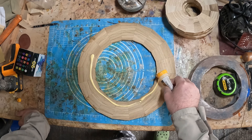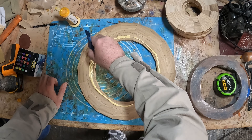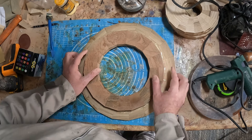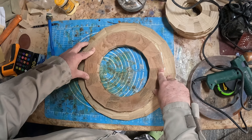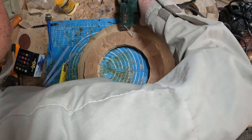On with the glue-up. First the top two rings — these were done with Titebond 2. A liberal layer was added, then the sapele ring was placed on top. I used hot melt glue to hold it in position, and this was put to one side on a level surface with lots of weights to squish the joint.